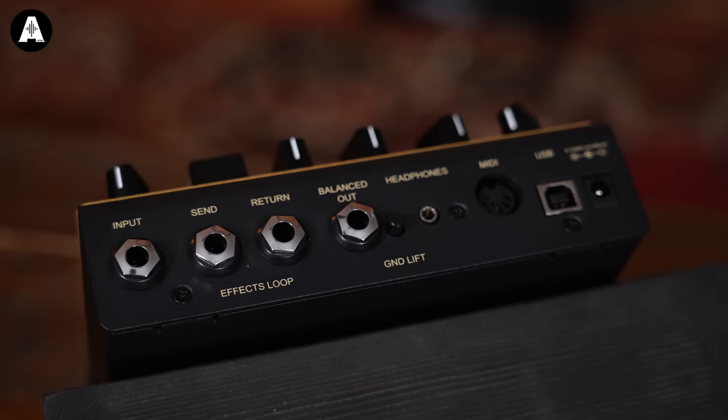And it is the identical preamps out of a lot of my products internally. It is all tube on the front end. I can see from the photographs of this that there are two 12AX7s in there. I can see also that you've opted for a reasonably powerful power supply. It's still an adapter rather than a mains sort of 110 volt or 240 volt. But I guess that's half the problem, isn't it, with using tubes in products like this, actually getting the tubes to run hot enough that they would emulate how they would be in a normal guitar amplifier.